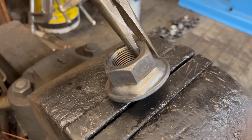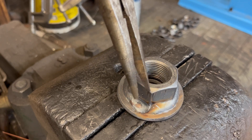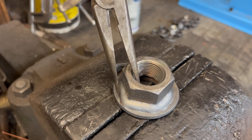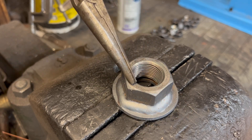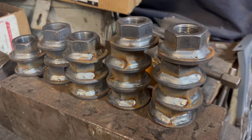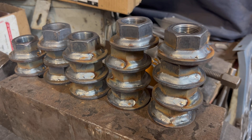Here's one of the completed pieces using the YesWelder. Now this weld will look a little different than if you're just doing it by hand because I'm using the rotary table. I just tacked it on both sides, and then I ran one continuous bead all the way around. I'm not a welder, but for what these are used for, this is a very strong weld. It was glowing — I had good heat, I could even see glowing on the inside. Right out of the box, the factory settings are really good. This is a little tricky because this is like 1/8 inch and this is like at least 5/16ths — two different thicknesses, not ideal — but the auto settings on the machine did a great job.